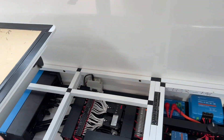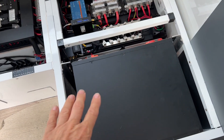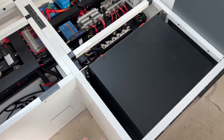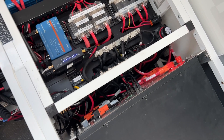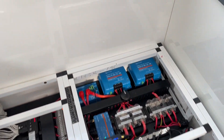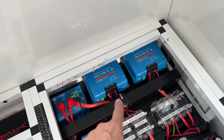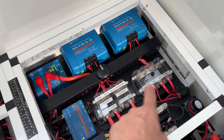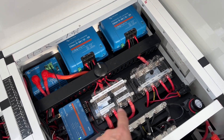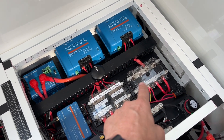In this van we've got a 6000W inverter up there — the multi-RS — and we've got the equivalent of 800 amp hours of lithium, which fits perfectly into the van. We get access to the front of the batteries down there. Over here we've got our 12-volt array that's putting out 12 volts for all the 12-volt devices, and then the bridge fuses in here. So we've got independent fuses running off to the batteries and then the distribution over there in 12-volt.